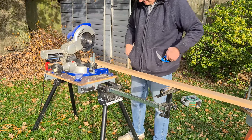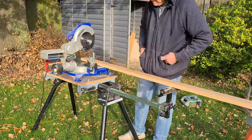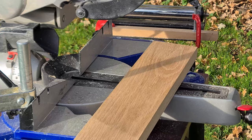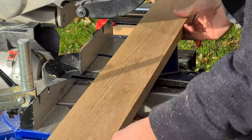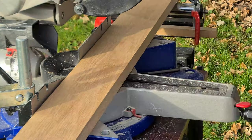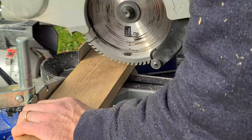As I had already cut a slot into the edge of the table edge, I decided to cut a matching slot into the edge of this 1-inch thick oak and then use a wooden spline to fix them together. This is the same oak as the lockdown bar. I thought it would look cool having it all trimmed in the same wood, like a proper old vintage table.